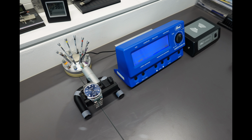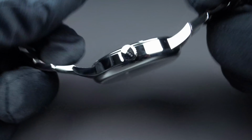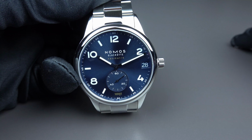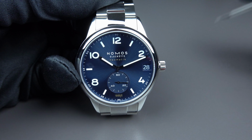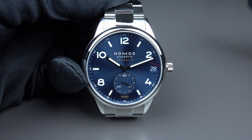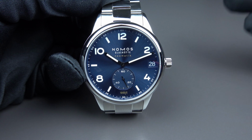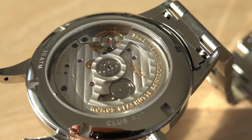And what I saw, I could not believe. I have been testing, checking this watch in 6 different positions, with the dial up, with the crown down, with the dial down, etc., the crown on the right side, on the left side, all positions. And the worst was -1 second and +3 seconds. So -1 +3 seconds. I couldn't do anything to get a worse result than this. 4 seconds. Please digest slowly what I have been saying. This movement is accurate to -1 +3 seconds.